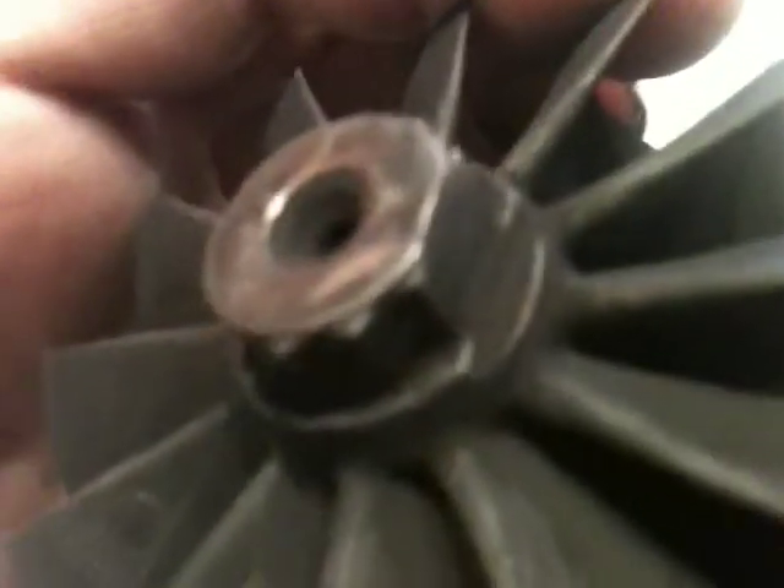This is probably from the factory; I don't think this thing's ever been rebuilt. Or they will sometimes take a chunk out of one side — whatever it needs to be balanced — or they'll try to find a corresponding location to rotate each wheel, and if it's in balance great, if not they might take a little bit off.